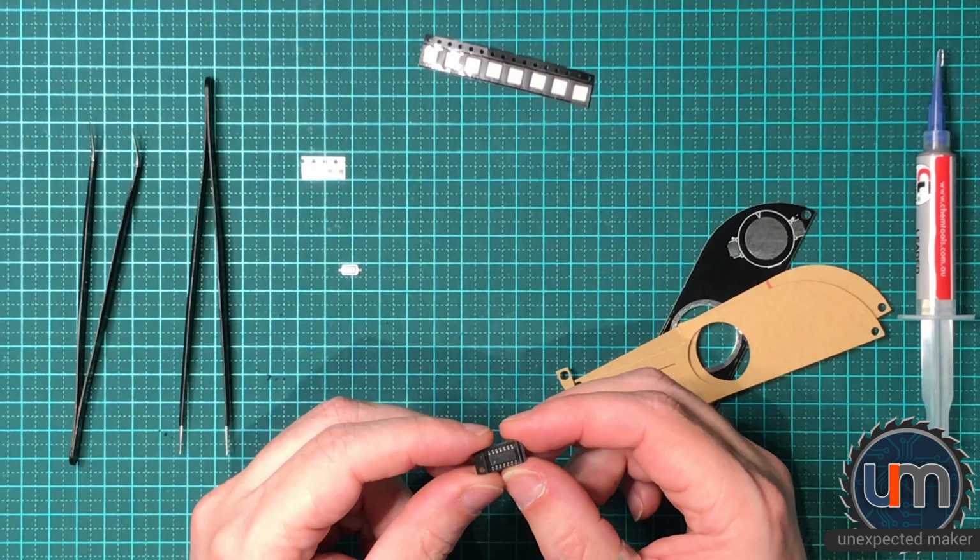I mean, I'm desperate to use it, but for those of you that know anything about the K40 laser cutters, they're pretty crappy Chinese type cutters. I mean, they work. Admittedly, they work. They're not fantastic out of the box, but they do work. But they've got some severe issues when it comes to the controller boards. They're just not very accurate, very fast, or very reliable. And the boards that come with them only work with this, I won't call it illegal, I don't know what I should call it, copy of CorelDRAW that'll only work on a 32-bit Windows operating system.